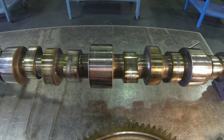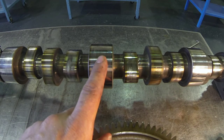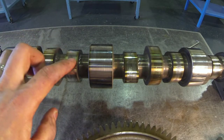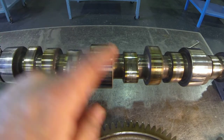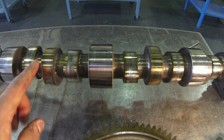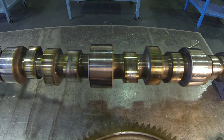That bluing is the coloring that happens when manufacturers surface harden or case harden the camshaft. We case harden the camshaft so there is a very hard, smooth bearing surface that the rollers or bearings can ride on. We only want to harden the surface and not the entire camshaft through its cross section, because it needs to handle torsional loads from the springs acting against the lobes at different times — this is how we get valve timing. So it is very common to see some bluing near or beside the bearing surfaces, as that comes from hard surfacing during the manufacturing process.